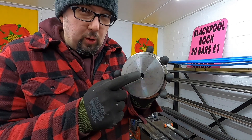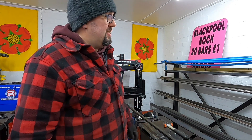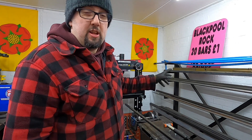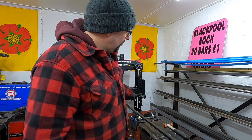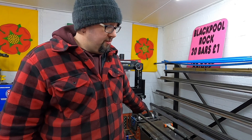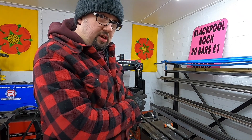Now the only problem is the hole in the middle is too small. So what I'm thinking of doing is pressing off the six inch wheels — because I don't have any material to make another axle. All I've got on the shelf is a piece of 50mm EN8 and a piece of 20mm EN8, and I don't have anything in between. So that's the only axle I have that's suitable for the bearings that I only have in stock. So press the wheels off, bore out the holes in the new wheels to fit the axle on the six inch wheels, and that should give us three quarters of an inch.